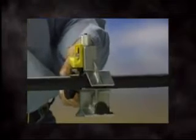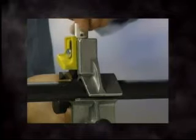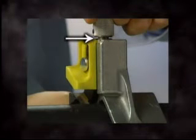Set the WS64U for mid-spanning by placing the tool on the cable to be stripped. Tighten the jaw locking knob to keep the jaw securely on the cable during the stripping operation. Use the knurled knob on the top of the tool to adjust the blade so it touches the outer jacket. By continuing to turn the knurled knob, a gap will open between it and the tool body. This represents the depth of cut the mid-span blade will achieve in operation.